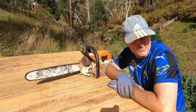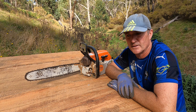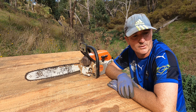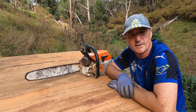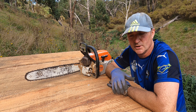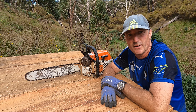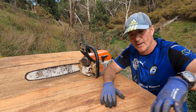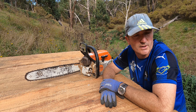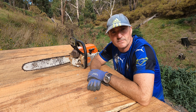Okay so that's it for this video - hopefully you've enjoyed it. The table's now all finished. I really enjoyed doing this one, I'm pretty satisfied. A bit of milling in there, a bit of log work, a bit of debarking and then fixing it all together. It is rustic - it absolutely is rustic - it's not like the ones you see that the pros do, but it's absolutely functional. I'm going to get a fire pit in this area as well and then this will be pretty nice. The only mistake or error I wish I didn't have was these tabletops - I was really hoping to be able to get them full length but I just don't have the right diameter wood to have the planks going along the length of the table. Having them perpendicular to the table has worked well and allowed me to use the wood that I've got here, ending up with a great garden bench.